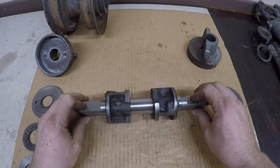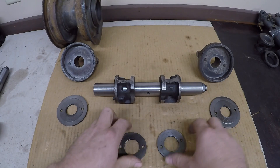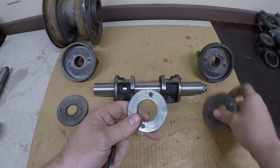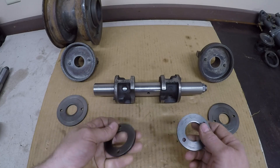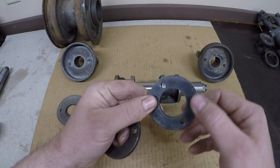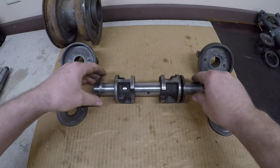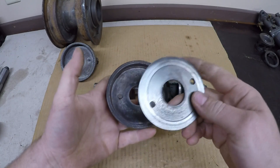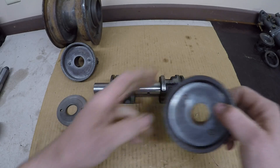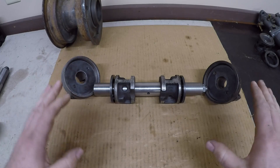We have a real nice fit between the bushings and the shaft — about 10 thousandths clearance — everything rolls well and should be pretty much back to new clearance spec. The last thing to assess is the thrust washers: they all started at about 0.185 thick, still in very good condition with about 5 thousandths wear each. I'm going to reuse them but flip them around and position the unworn sides out — that just resets the whole wear process. I'll do the same with the washers under the bearing caps.